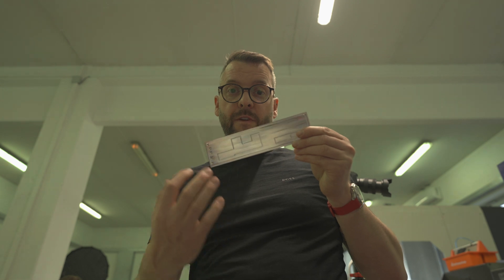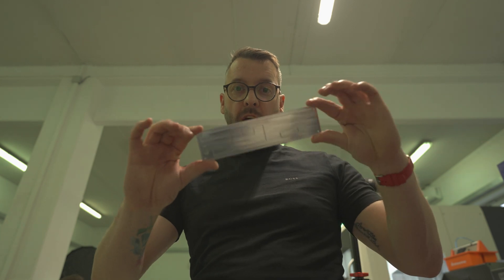First half of the IO shield is now done. With any product that's being CNC milled, it's usually done in two major steps. In the first step you take away material from one side as much as you can, and then what you usually have to do is take the part out, turn it around, and run the program in order to get the rest of the aluminum away. So first half done — second half, let's do it.